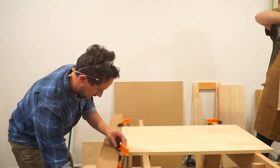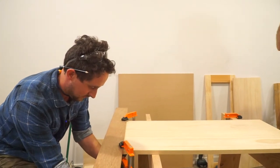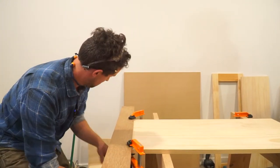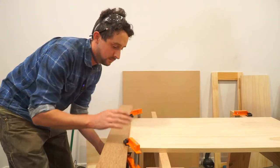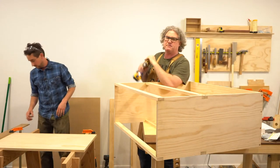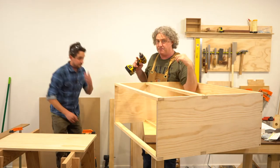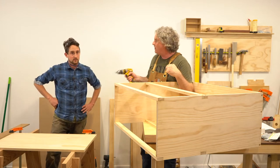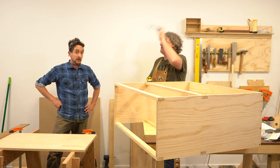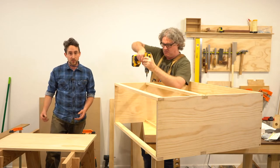Do you normally use a piece of plywood? I guess a piece of plywood is a good way to make a straight edge, because the plywood's going to keep its integrity, so to speak. It'll stay straight, as opposed to a piece of wood, which can move around a lot. If you're going to make a straight edge for your workshop out of found materials, plywood, and I reckon aluminium. I always have a great straight edge made out of aluminium, that I bought at a hardware shop. Yeah, you want something that's not going to bend with moisture.